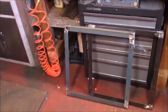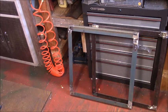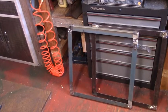I'm going to take a quick rest with this, and it'll probably be starting in another video before I finish even assembling this. The main thing is I've got to drill the holes and put the casters on, which I don't have yet, and also I'm waiting on the pulleys because that's going to dictate a lot of how this is going to be put together. Because bed rails are very difficult, I'm not going to hand drill them — they'll either be drilled on the drill press or the mill. We'll probably do all that and then start putting the other parts together. I may even put studs down and do it. Right now I'm still undecided till I get to that.